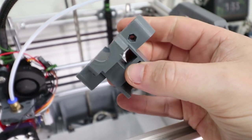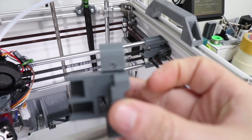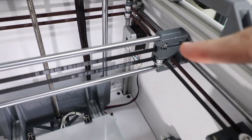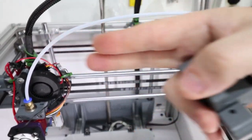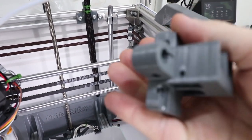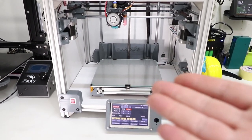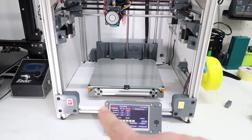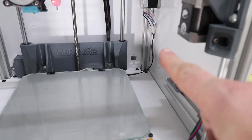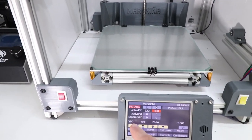The X-axis carriage piece has also changed. The old piece had a very narrow section where the rod passes through, while the new piece is much wider — this prevents the X-axis from flexing too much. The new electronics are hidden below the metal plate, keeping everything very clean. There is still one cable not fully placed and LEDs still to be added, but overall it looks quite clean and nice. Let's try doing a homing from here.